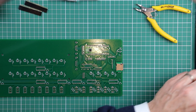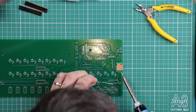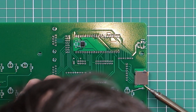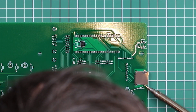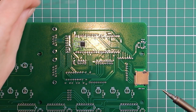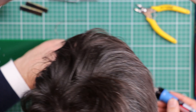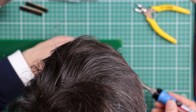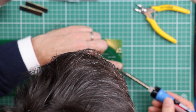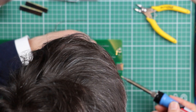Clean the tip of your iron. There's a lot of ground plane here and the metal shielded casing is going to soak up the heat. So get your iron firmly on both the pad and the case, let plenty of heat in, feed in a bit of solder, then let go. If it looks like the whole thing moved and those leads aren't sitting in the middle of their pads, it's not too late — we've only done one point. Just heat it up, let it reflow, and wiggle things around to get those pins back in the middle of their pads.